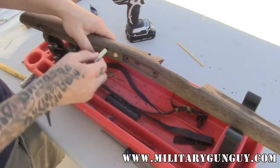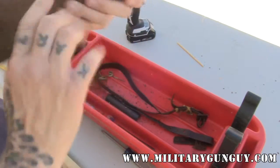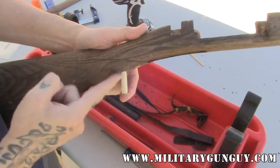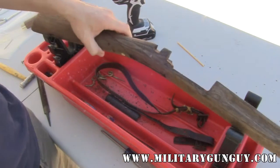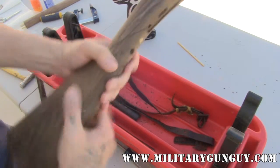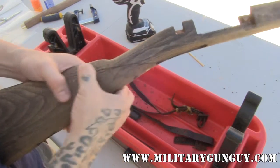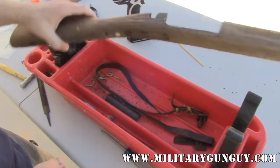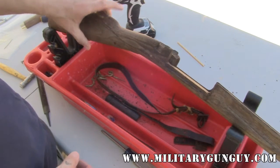I am using a wood screw with that concave head, and I'm basically screwing this in as tight as it'll go — so your repair is down in there. Then you're going to take epoxy on your dowel and just dowel it in place. When you're done you're going to trim it and blend it. We're going to trim this flush, use a file to clean it up, then finish by staining it. The screw on the inside is going to hold the two pieces together. I'm going to epoxy the outside, since once this is done it's never going anywhere — it's just a matter of cleaning up this crack.